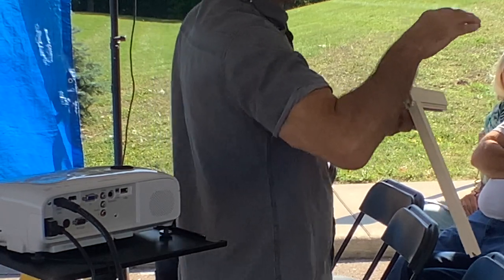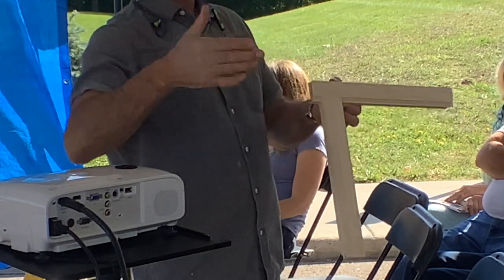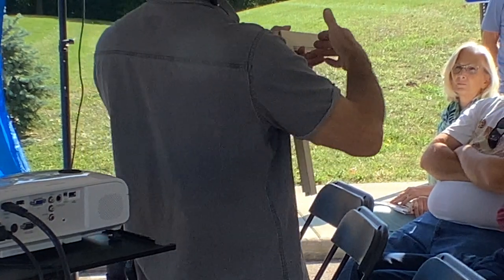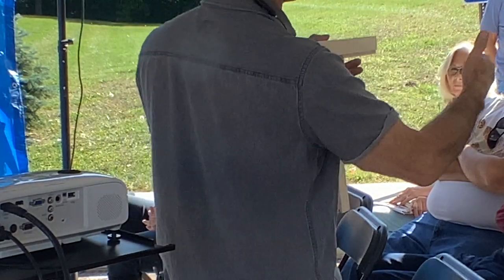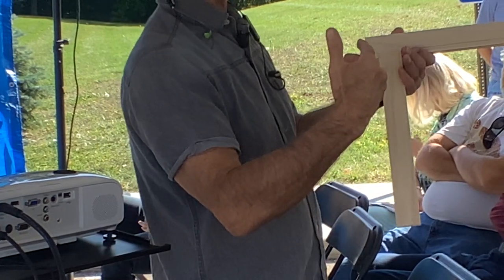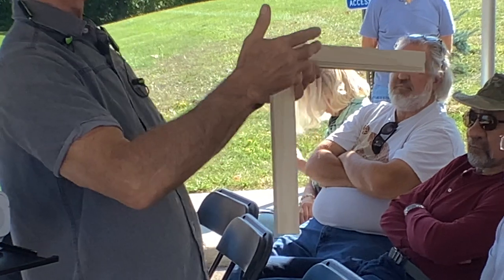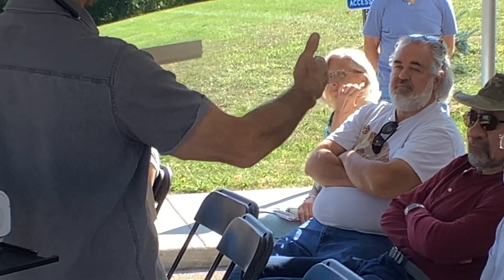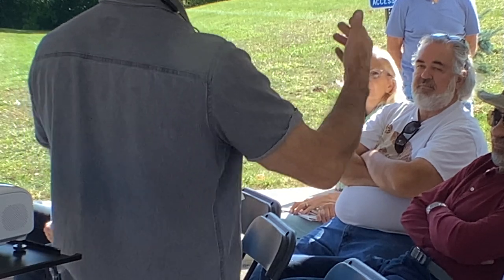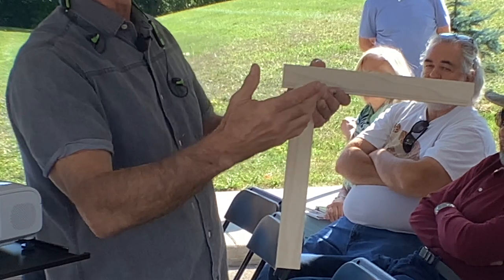So it's like, in woodworking, we trick stuff like this all the time. When you put a leg and rail assembly together, you probably have a reveal. Isn't that a nice design feature between the rail and the leg? Well, it's really there to make our lives easier. Because if you try to make the rail and the leg perfectly flush, and they're not, you can tell. If it's a quarter inch reveal or a 9/32 reveal, is that right? No. Whatever. If you miss your reveal by a 32nd, nobody's going to know.